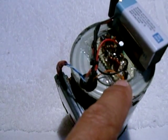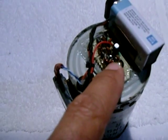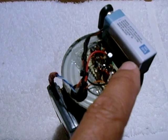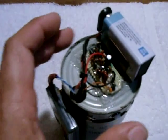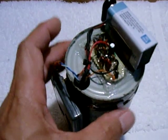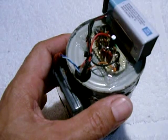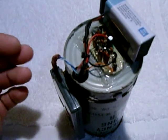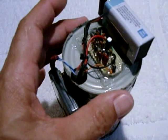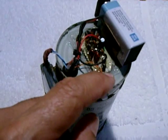This particular unit is a 9-volt unit. You'll notice right on top of the board — it's about two inches long by an inch — there's a whole bunch of components. This is a 50-volt board: it takes the 9-volt battery and boosts the voltage to 50 volts. The entire housing of the chamber is positively charged to 50 volts — that's how this circuit is designed.